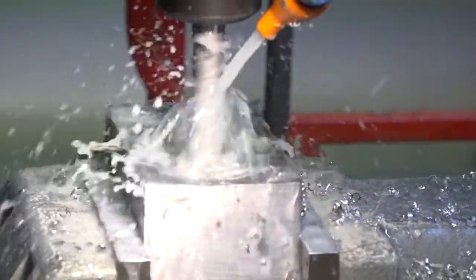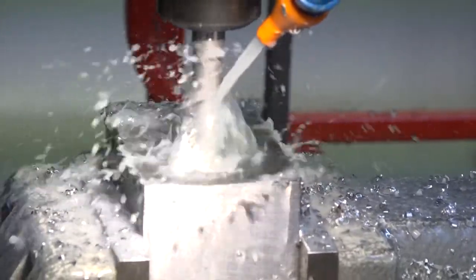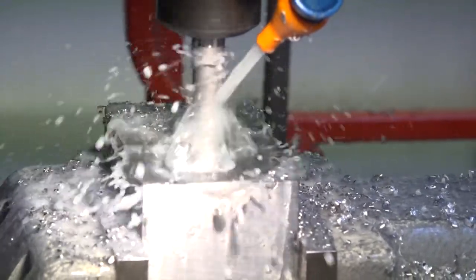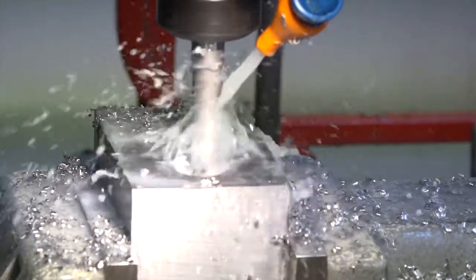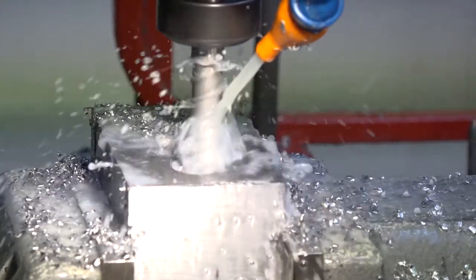You can produce any hole. Once you get to the 65 millimeter hole using the 32 millimeter diameter cutter, it's infinite — if you want to do a 200 millimeter hole you just keep pitching across and getting bigger and bigger. And looking at the design, it's very rigid. We do a solid carbide through-coolant type with a cartridge on the end, and a solid tool for non-through-coolant machines. The core body is solid and bigger diameter. The helix on the drill itself serves two purposes: it draws the coolant down onto the work area and helps evacuate the swarf.